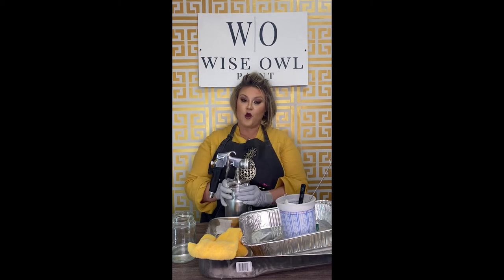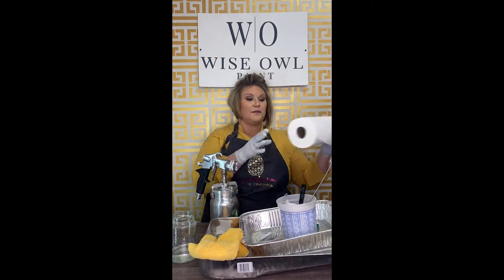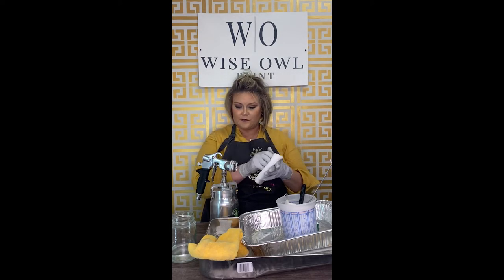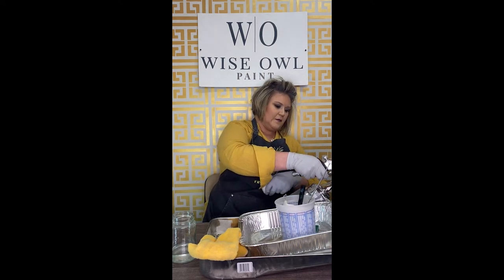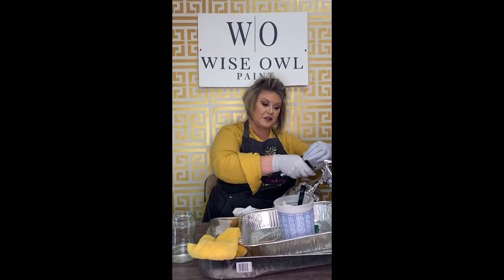You do not want to open up this yoke-style lid, because it can blow back the contents of the pressure cup onto you. It will be a blast of air. It can be dangerous. So you'll want to pull back your trigger until all the liquid and the pressure is off. That shows you how much pressure is still going.